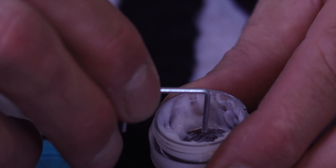The next thing we had to do was a really simple mod — lubing stabilizers, but you also want to mod your stabilizers. They have these little tiny feet that are really easy to clip off. I just use fingernail clippers — I find that easy, and you always have them sitting around. These are remnants from the really early days of MX switches, but you can clip them off because that's what causes that terrible sound when you're hitting the space bar, shift, or enter. Then we're going to dip the stabilizer rods into some Krytox as well.